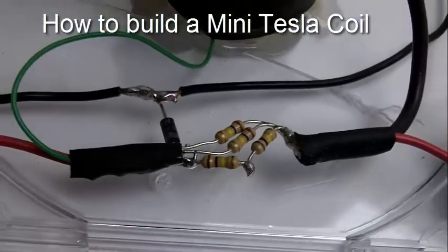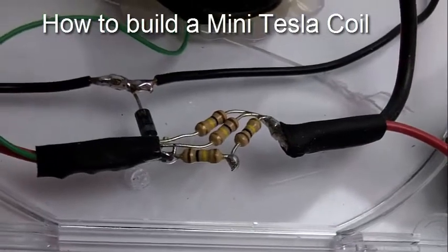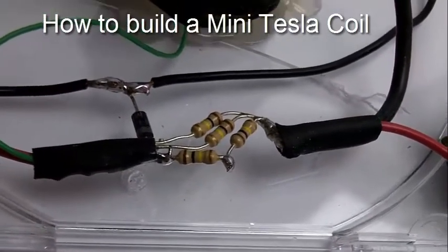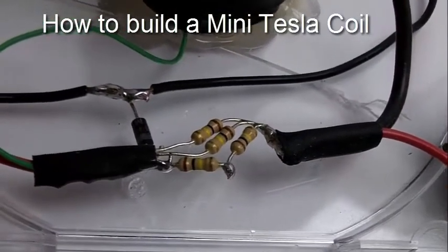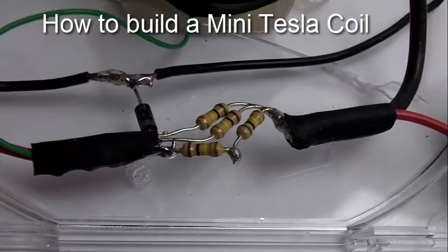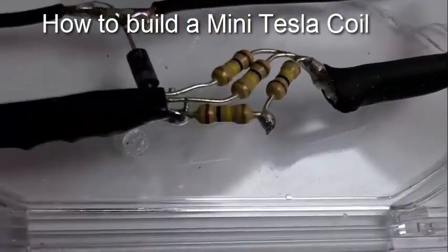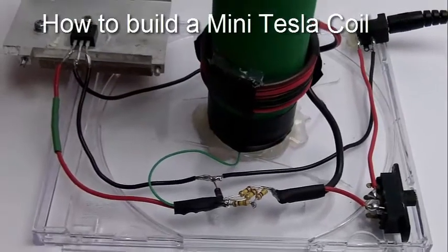Now I'm not exactly sure what I did here — I was experimenting. Here you see a couple of resistors in parallel and two in series connected in parallel. I think they're all 100K, which works out to be about 40K. But normally you would need maybe 5K or 4.7K at half a watt. And then you see the diode. I will draw up the schematic for you.